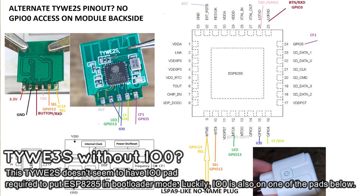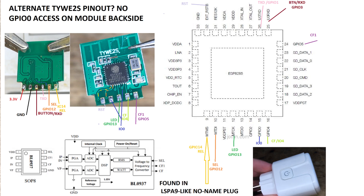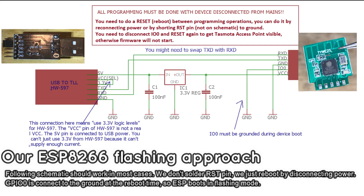See the schematic on the screen for the full pinout of that module. This is an ESP module, so we need to solder 5 wires. We are going to solder the 3.3V connection, ground, RX, TX, and IO0.